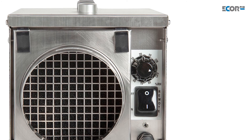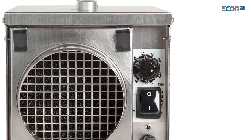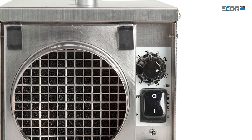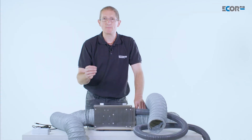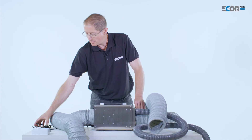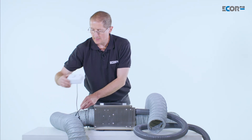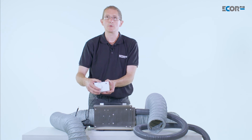To control the relative humidity, we could simply use the inbuilt humidity stat, which is going to monitor the value of the air going through the machine. Or if you want to be very specific about controlling the humidity in the room, we would use the remote humidity stat, which is simply plugged into the machine with the sensor kept in the room that we want to control.